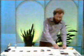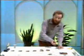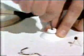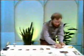For that, we've used a cup hook like you get for ordinary kitchen use. Just remove the hook with a pair of pliers, like that, and then make a hole in the back just big enough to take the phototransistor. I'm using a drill bit because I think that's probably the safest way. And then mount the phototransistor with the sensitive end into the mouth of the sucker.